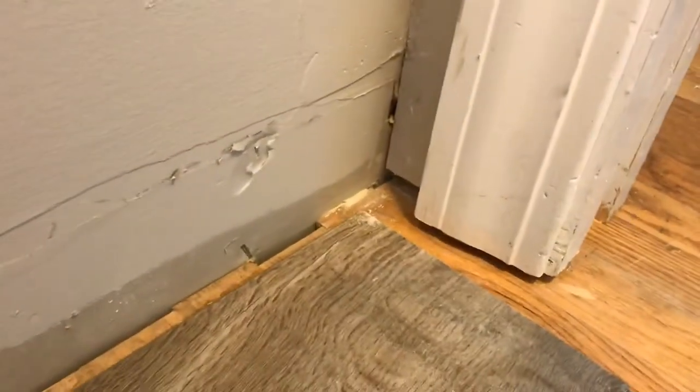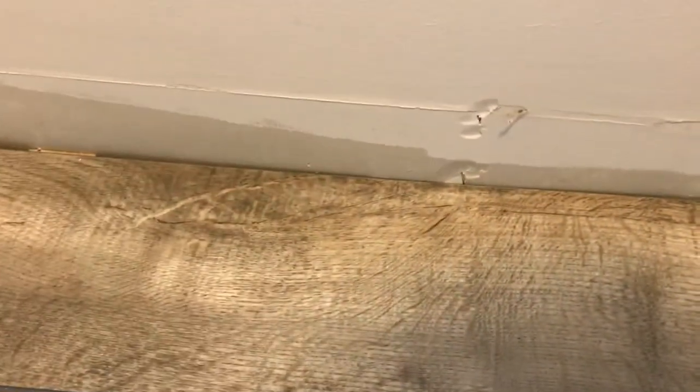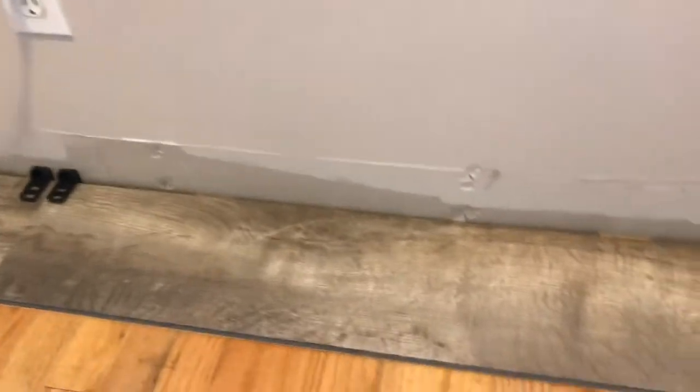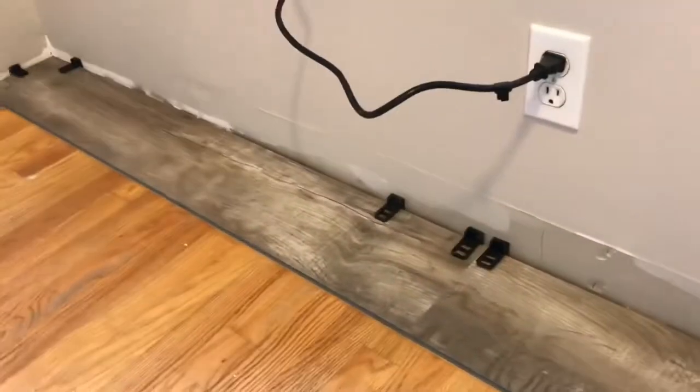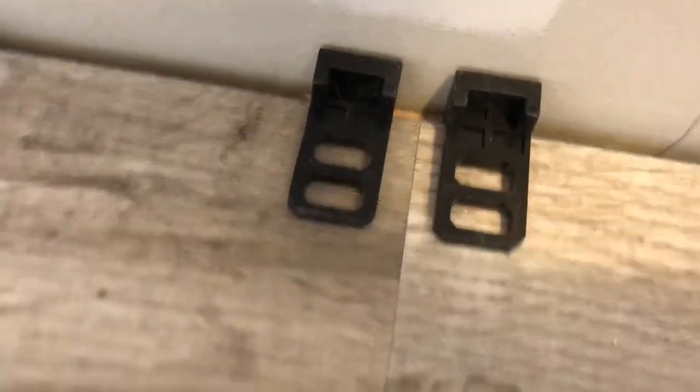Once you have it cut all the way through, you take your piece and you slide it right in. So it looks nice and neat, okay? And we're going to continue that across the room. Let's put our spacers in, and that'll be it. Can't emphasize enough, the first course is very important. You want it on the money. You want it jointed tightly, okay? And you want these spacers in, even where the two pieces meet.